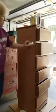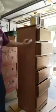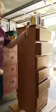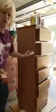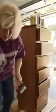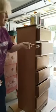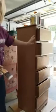That's what I use. So, let's pretend I'm painting this. I'm going to do my painting right here, right? Got my paint on here, got my roller ready. I'm going to paint like this. Right? I'm going to take my wonderful, high quality brush, and you're going to go down. So that's what I do to get a smooth finish. I do my roll, right? I do my rolling, and then I take my high quality $1 million brush you paid $1 million for. You're going to use that, and it's like feathering. So you're going to feather down, right? Like that. And that smooths any problems that you had, right?